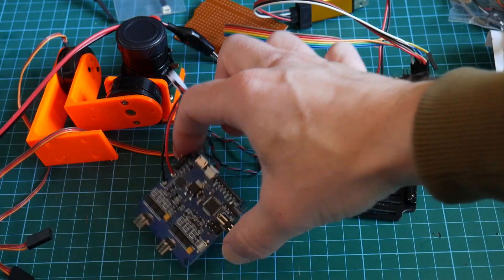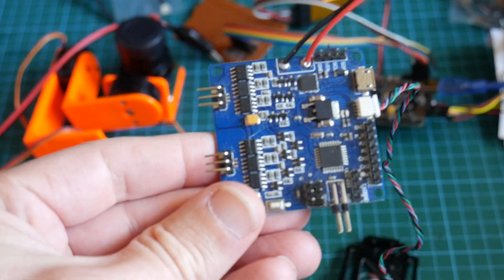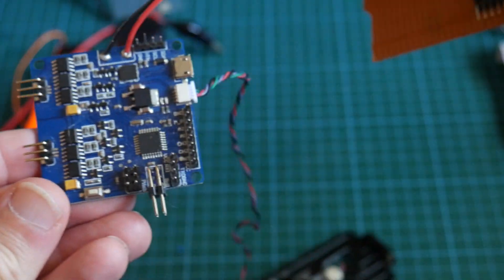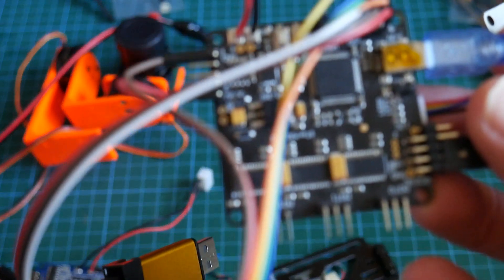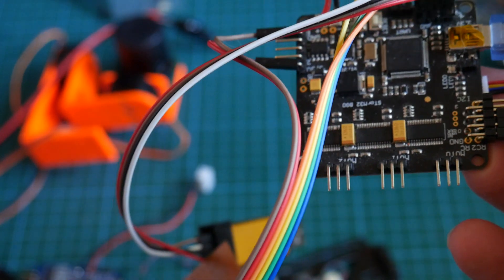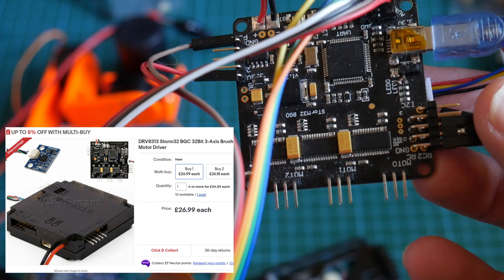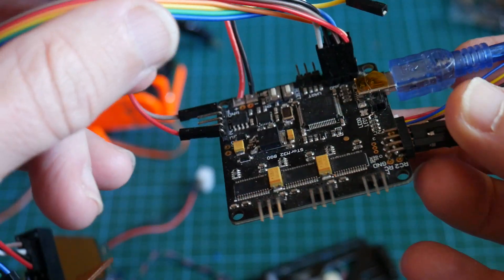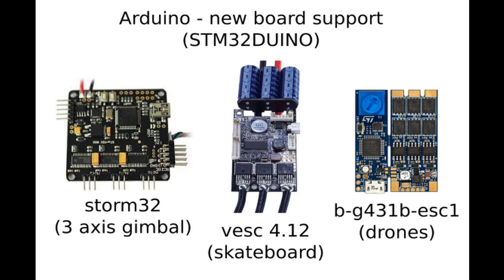You can pick these BGC boards up for about a tenner — they're very similar to Arduino Uno boards with about the same memory and speed. I'd actually recommend going with one of these Storm32 boards instead. They're four times faster, they've got loads more memory, and they've got a decent chip from TI — the DRV8313 — to power the three motors. I'll likely be using this for my gimbal on my hover chair. As well as the video recognition gimbal, I'm halfway through adding Arduino support for three boards: one for gimbals, one for a skateboard, and one for drones. It should make these boards much easier to use from within Arduino.